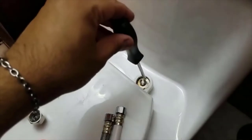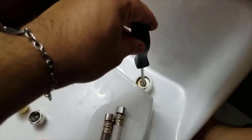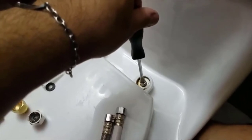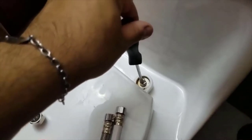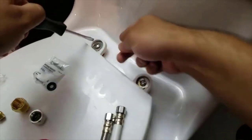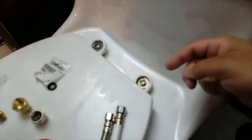Removing your toilet seat is very easy. You just kind of unscrew — go underneath, there's usually some sort of nut — and just unscrew. You can also just do it from the bottom by pulling off the nut, then repeat it for the other side, which I already did. And the seat will just pop off. I'm not going to do it quite yet because I'm using it as a desk.